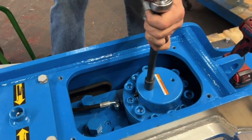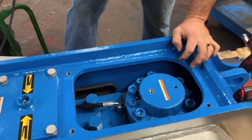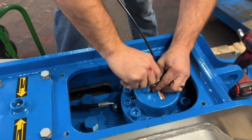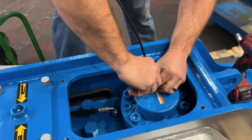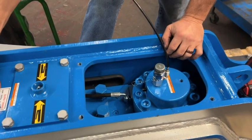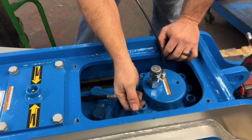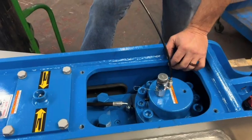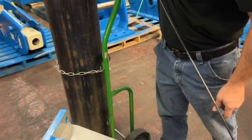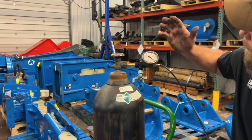We'll take this off now that we know our gas valve is closed. Same type of little plug with an O-ring. At that time, you can put your check valve in here and tighten it up. On this one, the thumb wheel doesn't do anything - it can be in or out. What opens up the air is this valve here. The spec on this one is 780 to 850. Give that about a half turn open, and our gauge is about 830 or so, which is well within spec of 780 to 850.